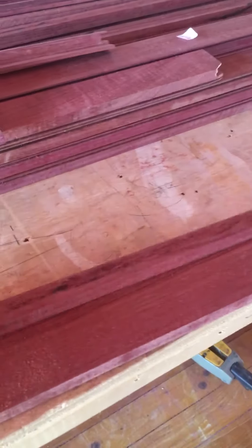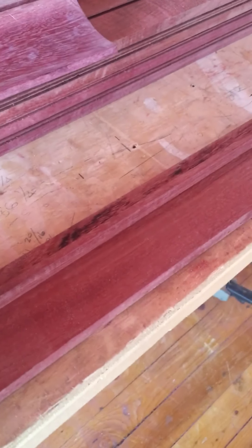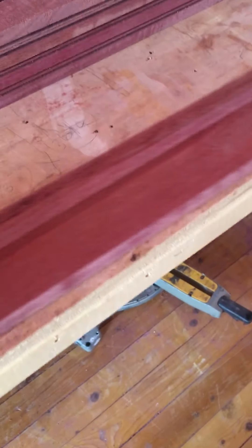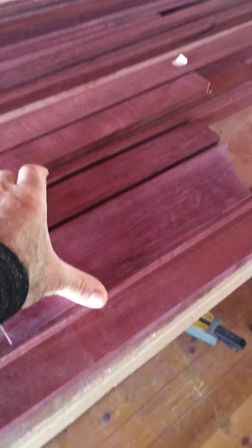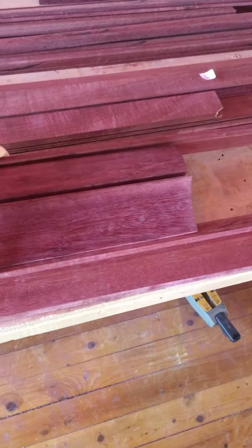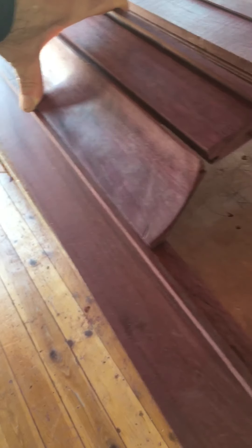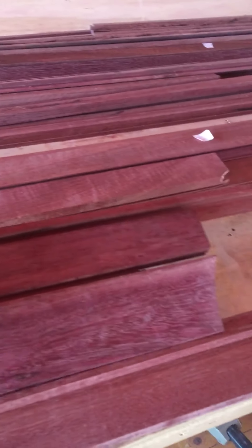The way we set it up is we have the top piece of the face frame extended, so when you put this together you still have your two-inch margin here, and then your doors start here with the shadow line. The shoe goes on first, and then the crown comes on and sits in the shoe like this. You can see the crown right there — it comes off that shoe molding and extends up, and that's how it gets assembled.